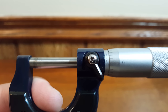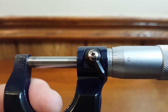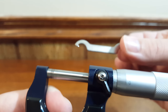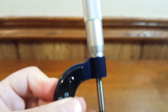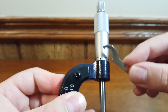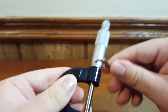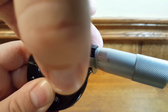If you've checked your zero and things line up then you're good to go. But if your zeros aren't lined up, you'll need to calibrate the mic. When you buy your mic you're given a tool — if you spin it over you'll find a hole. All you do is lock this into the hole and twist it to overcome a friction fit, and you can line your zero up to make sure it's calibrated.